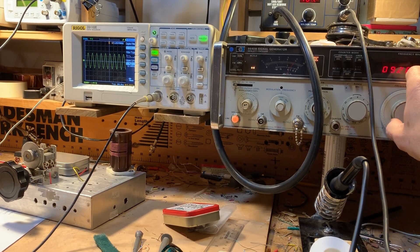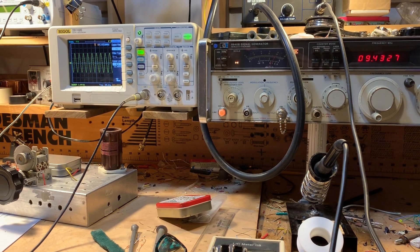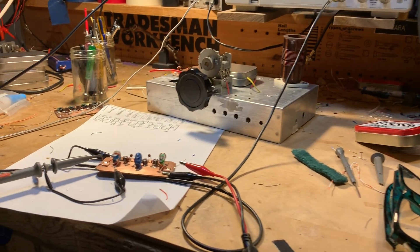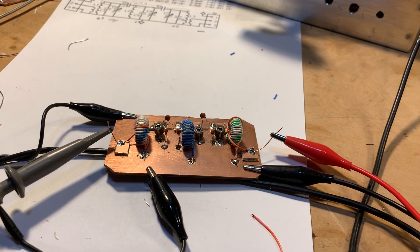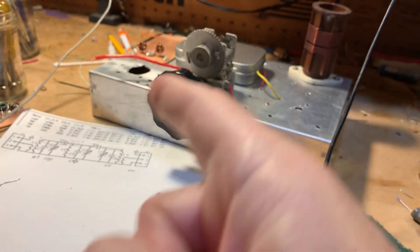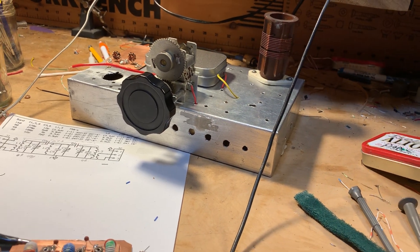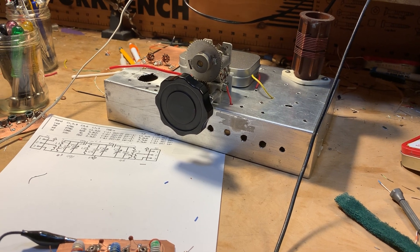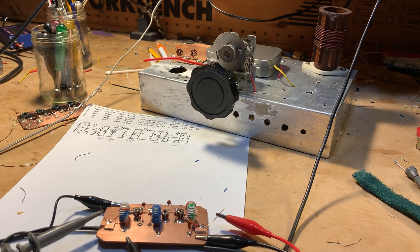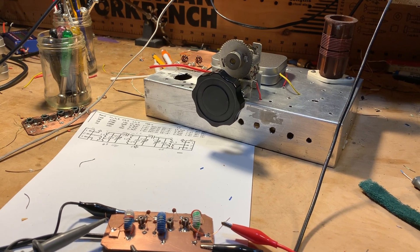Going up — by 10 megahertz it's really significantly down, so we're getting the right frequency response. The thing is working — this is what I was hoping to see with the first filter yesterday. These are the trials and tribulations we often talk about on the Solder Smoke podcast. Next I'm going to build an RF amplifier to go between the bandpass filter and the diode ring mixer. At that point we'll be taking RF from the antenna through the bandpass filter into the mixer, combining it with VFO energy and getting 455 kc out, then working on the IF amplifier chain and audio amplifiers. Thanks to W8DIZ — Diz from Kits and Parts — for the circuit and the parts. Stay in the shack, stay safe, flatten the curve. 73.